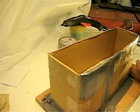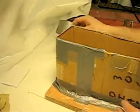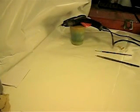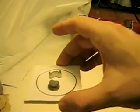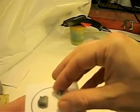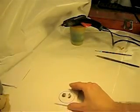And that's it. I'll do a little bit more, but right now I want to cover the one part mold. Let's push this to the side. What we're going to be doing as a one part mold on this particular sculpture is the mouth dentures. I have a small piece of foam core here and the dentures for the mouth. Two small pieces. What I'm going to do is glue them onto the foam core here. I made a circle to keep them inside, so let's glue them in place.